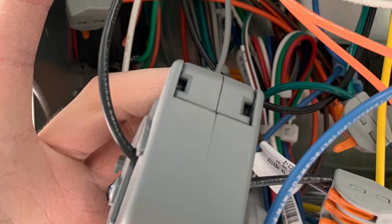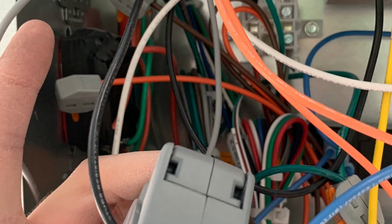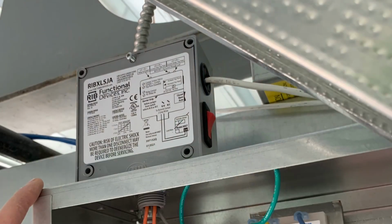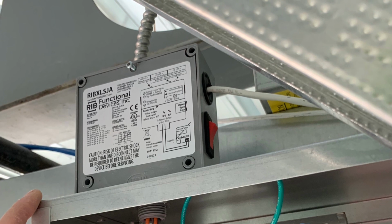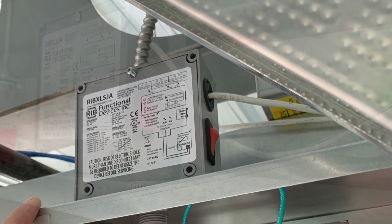Here is another picture of the control transformer, which you have to hook over this one certain black wire coming off of the back, off that little thing that I can't think of the name of right now. The other wires I have to hook up are the orange and gray wires. Two gray wires go to the control transformer, and then the one orange wire goes to the black, another orange wire goes to the blue, and then a white wire goes to the yellow.